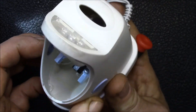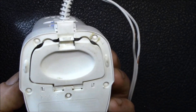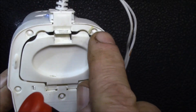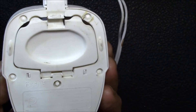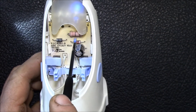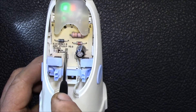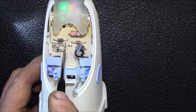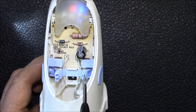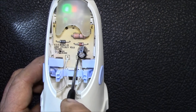There are no screws. Here are your switches. The way they build this is everything snaps together inside, and then they come in with this base plate. There are what looks like seven pins that must stick through — they slide the base plate over it and then probably either ultrasonically or thermally weld these pins down to make rivets. This whole thing is put together without a single metal fastener. On the circuit board, I haven't been able to find out who made it, but there is a reference to this chip set — the ROX R1.0 ASIC on the back side of the board. It's a chip-on-board construction that drives the three LEDs and has two switch inputs. This resistor is just hardwired across the incoming power.